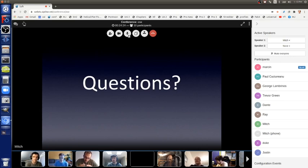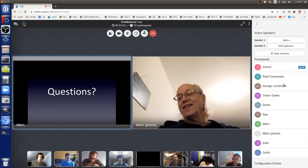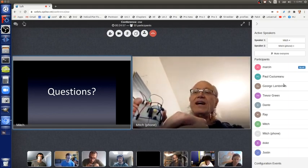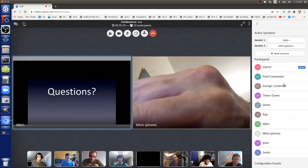I have some other parts there that are definitely optional, like the reset button, and the power LED is also optional. You also don't need to have an LED connected to pin 13, and all Arduinos come with a visible LED connected to pin 13, which is why I chose pin 13 in my example earlier. But you don't need that. It's just nice to have because then you know it works. And a power LED. So here's my minimalist, oops, here's my minimalist Arduino.